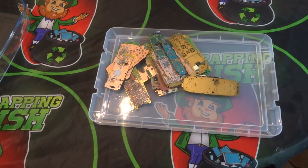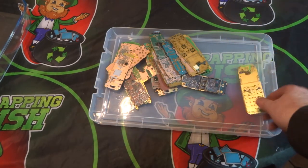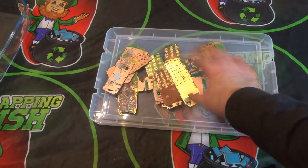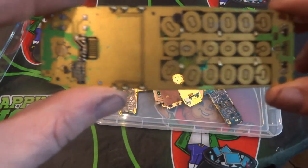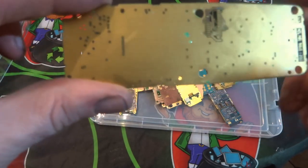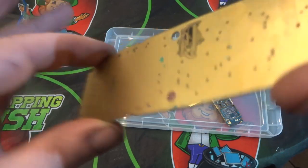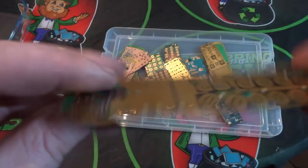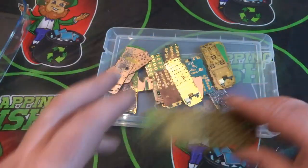I've washed off these boards now — washed any of the caustic soda away from them so I can get a better look. I'll go through a few of them to give you an idea. That one there was completely gold-flashed underneath — sorry, I keep saying gold-plated, it's not gold plating, it's just a very minute engineered gold layer. But if you have enough of them it'll add up. You can see by the shine on it that there's gold underneath.